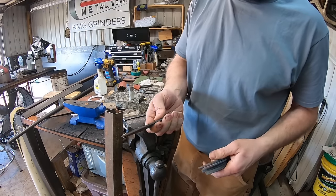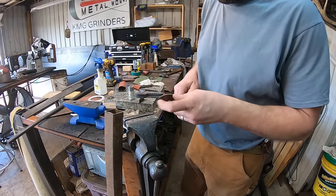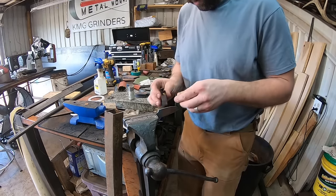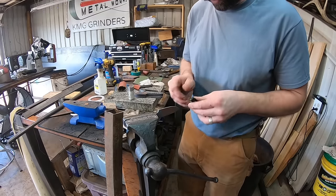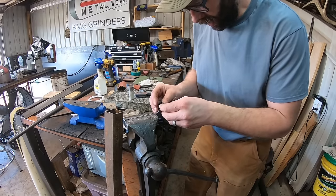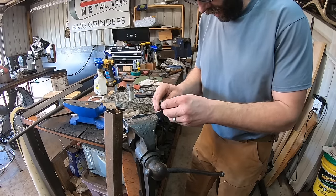Alright, the Lockslaw River Skinners are out of the final cycle before hardening. So the next thing I'm going to do is put a rough grind just to remove material so that we have less material at the edge to cool. It's also less hardened steel to grind. Is this absolutely necessary? No, in this stock dimensions, the steel will still harden adequately, I think. But it'll save a little bit on the grinding belts, and that's a good thing too.